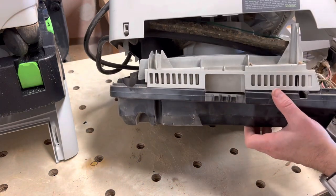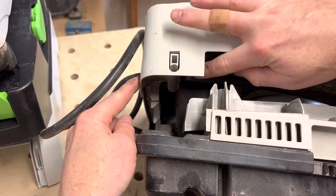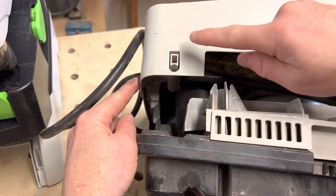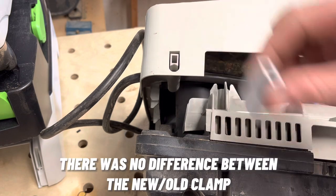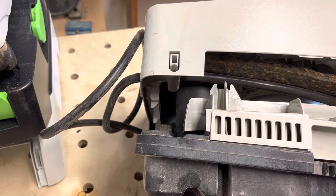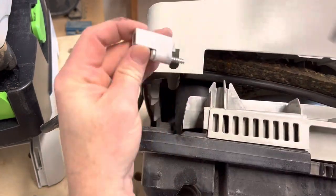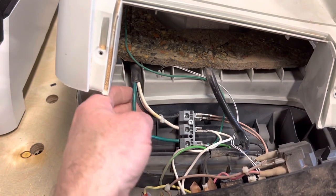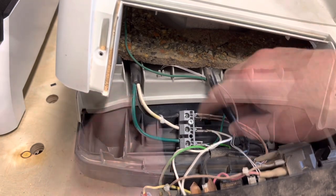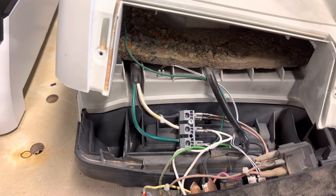Okay, so the power cord — we're still hung up in the back here. The AC cord comes through here, and I think we figured out what that little piece of plastic is for. This looks strangely familiar. So let's go ahead and back this screw out. That piece just acts as a clamp. The power cord comes down through here, and you've got your ground, your neutral, and your hot wire. They all come into this splitter that has more Torx screws.